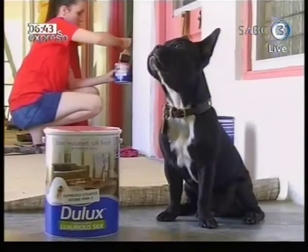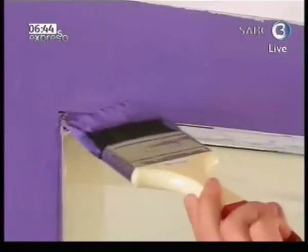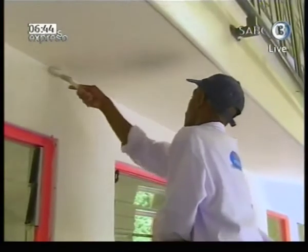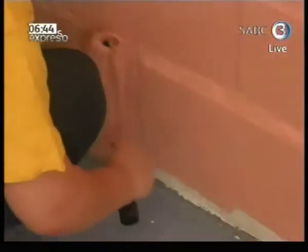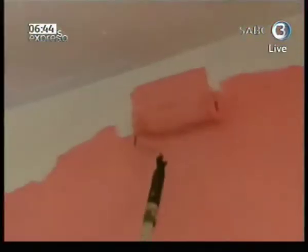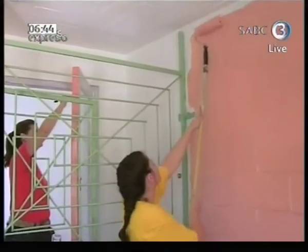Baba, four-legged presenter, also lent a paw. The walls were previously painted with high gloss enamel. High gloss enamel is too smooth to paint on without a primer, so we use Supergrip to apply a primer. Supergrip dries in two hours, so you can still apply the top coat in the same day, which saves a lot of time on labour and the job can get done quicker for the client. It's a water-based paint, so the fumes are much lower than oil-based paints.